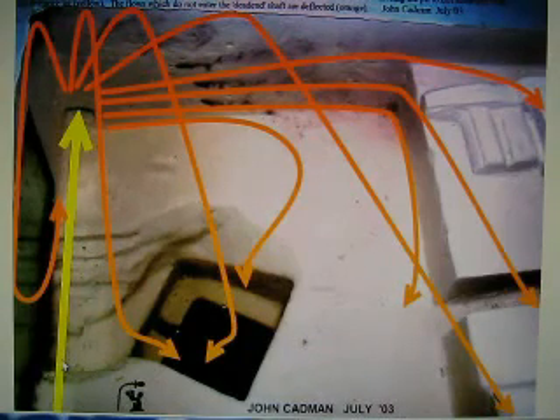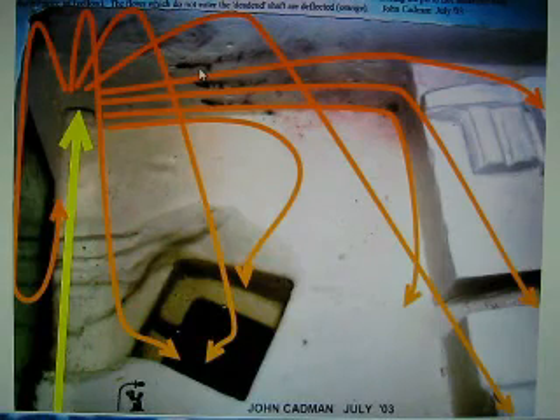This is how I determined the flow — using ink from the entrance room. It goes across and actually shows it going down on the floor at this level, dropping into the pit, going across, hitting the step face, and then being redirected by this channel. That explains the channel — it redirects the fluid flow. This is overhead. A fluid jet goes in — you can actually see where it's lighter in this area because there's no ink there. I have ink jets here at multiple points. You have a lower level that comes across, hits the face, and curls. You have a mid flow and an upper flow that uses the ceiling. Some uses the ceiling and goes across the room; some uses the ceiling and drops down to the pit. This circles and actually presses down, lowering the overall level of the jet. True genius — every part of this has a function.